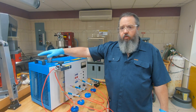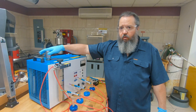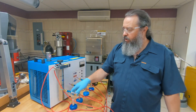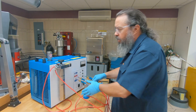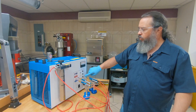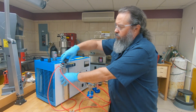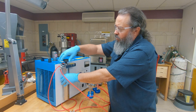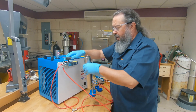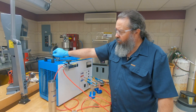You're going to refill your electrolytes or top it off with distilled water through this pressure cap, and you don't want to remove the pressure cap before you remove the booster tank. The first thing you're going to do whenever you need to top off your fluids — you'll know you need to whenever the yellow light comes on — is pull the booster tank. At this time you can top off your flux solution if needed, and then go ahead and remove the pressure cap.